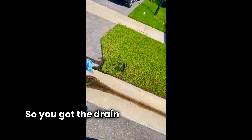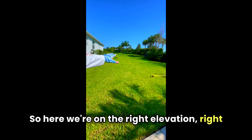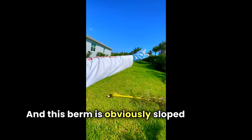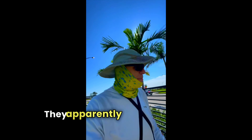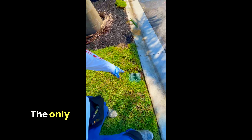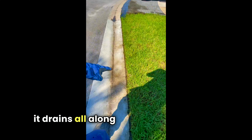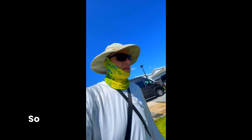This is a neighbor's house — check this out. There's a drain coming out right here. I think I found the source of the water. Here we are on the right elevation — this is the end house on the street and there's a nice berm. There's a main road right here, and this berm is obviously sloped towards the house. There's a drainage system installed that's supposed to kick out right here, but the problem is it's set too low. Instead of draining directly into it, the water drains all along that gap and ends up causing more of a mess. So they're going to have to fix this as well.